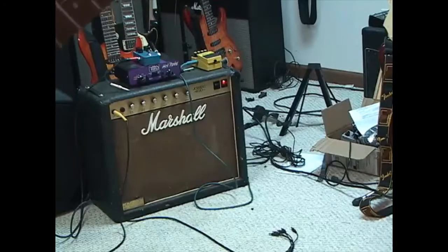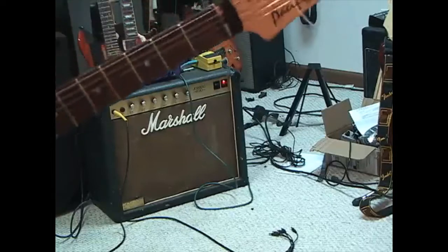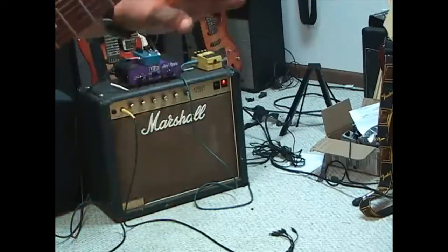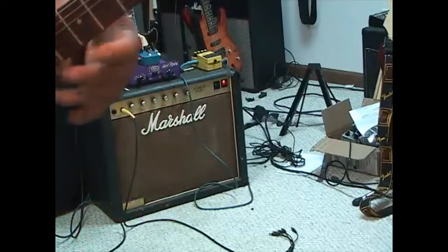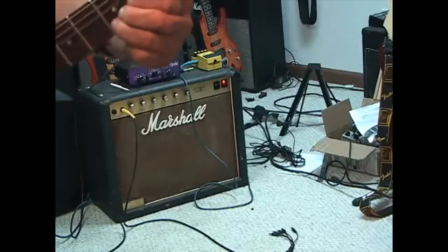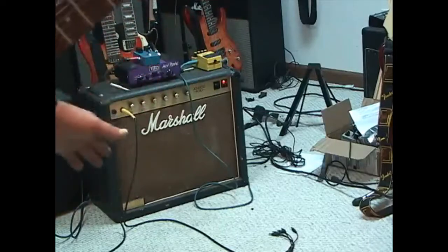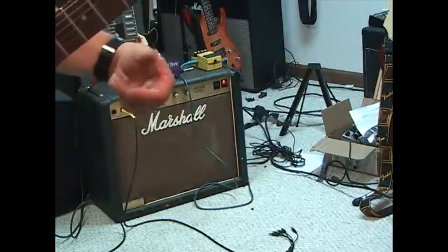Like take the normal channel and crank it up, which is pretty much the same circuit as a plexi. And then the JCM800 just gives a little more preamp overdrive. This amp has a normal biased first stage in the normal section, and so it makes it a lot more useful. Especially with the master volume in the back, because these are loud amps. I mean, even with a 1x12 speaker in it, they are so loud.